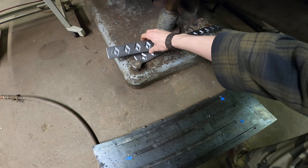On the flip side, this is what I do my scales with — four scales total. Jeff Dumont recently got these templates done for me for engraving diamonds, and they bolt right onto this machine as well. That's how I do my scales — I can do the counter bores, all the holes, hole patterns, and other stuff all on this machine.